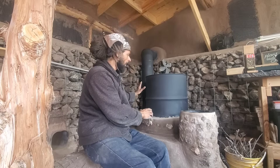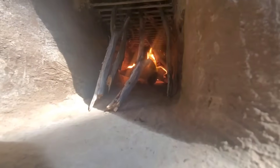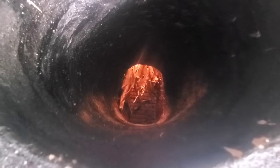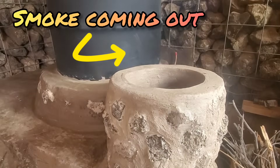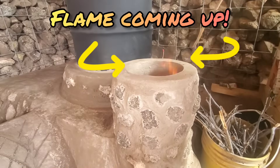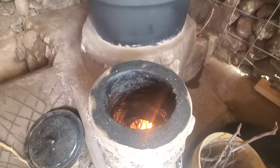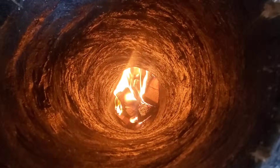It's super important to get the middle tube — the tube inside of the barrel — heated up adequately, because otherwise there's still a cold draft that's pulling the hot air inside. Because everything is probably still a little wet since we just finished this, there's some wetness to the whole system that will contribute to things not working properly, so proper dry time matters. But otherwise everything is working — we've got the cardboard going, everything is cycling through, and the tube inside is actually getting pretty warm. The experiment with these systems is just fine-tuning everything and making sure we don't smoke ourselves out.